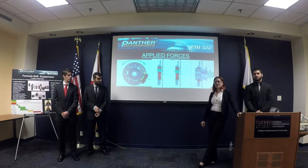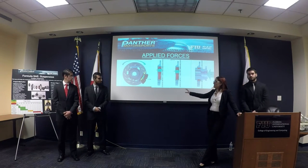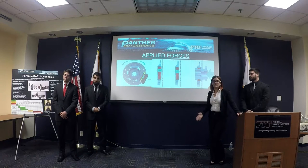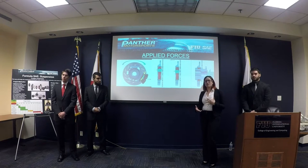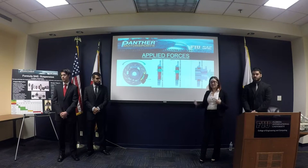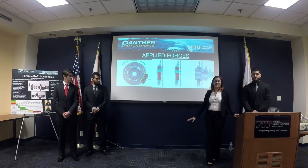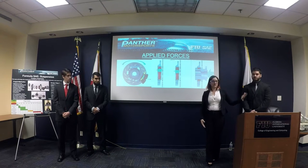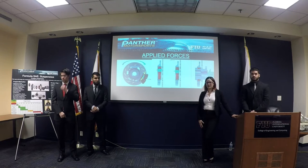Well, compared to last year's design, it's a higher factor of safety. And last year it competed and it's still a running car. But also our simulations are even higher in the range of what FSAE requires you to do. So we definitely looked up and spoke with some professionals on how to do this, and this was one of the ideas that they provided to us. So not only did it give us that higher factor of safety, where we took into account all the loads and calculated them, but we have also seen our car from previous year that had even a lower one, and it ran and it competed, so that's why we're currently okay with our results.